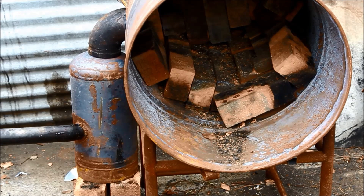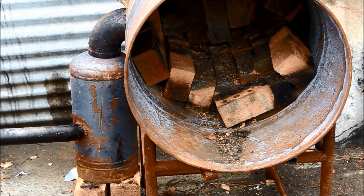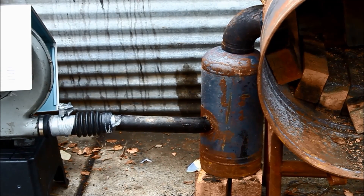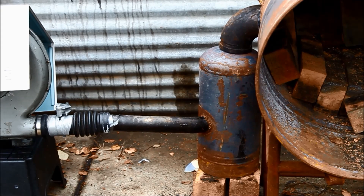The bricks will also help make the steel drum last a bit longer — it's pretty easy to burn the bottom out of these things with the blowtorch from hell aimed at them. I'd like to get a few more runs out of this before it falls apart. I've also turned the burner back up vertically, really for packaging reasons, and it's a bit easier to light. It allows a straight shot into the blower, which gives more air than using a hose, which always reduces airflow.